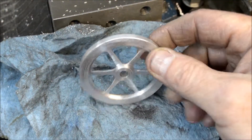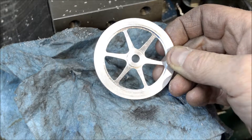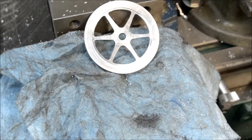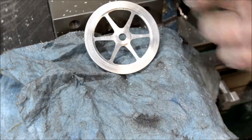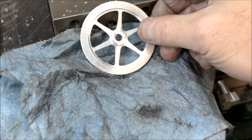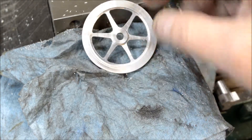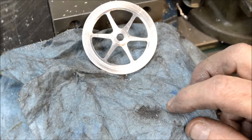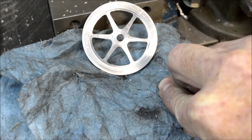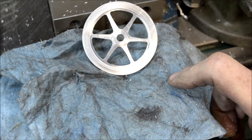So there's the flywheel — all done. I wish I could be a little bit more scientific on how I figured out the angle to cut those spokes, but I just eyeballed it and it came out pretty decent. I cleaned it up with a file a little bit and got all the burrs off. Out of all the pieces so far, the flywheel is the most challenging. Got quite a few parts done so far — we'll keep going along. Hope you guys continue joining me here. See you soon, thanks for watching.